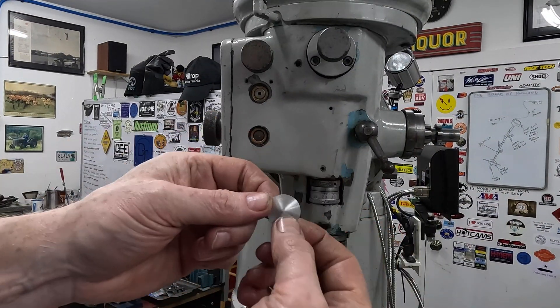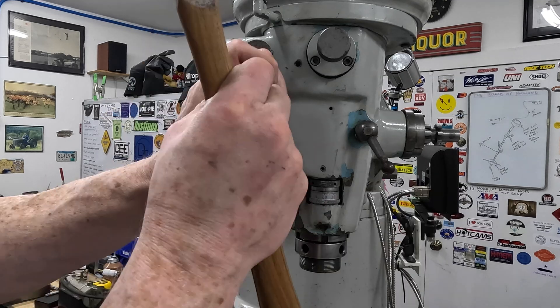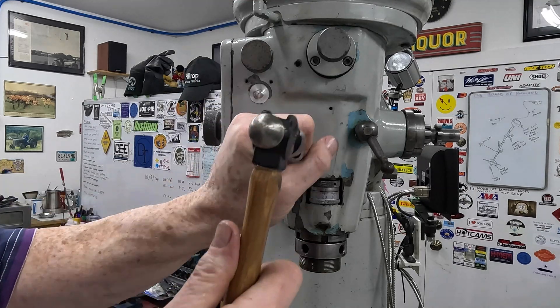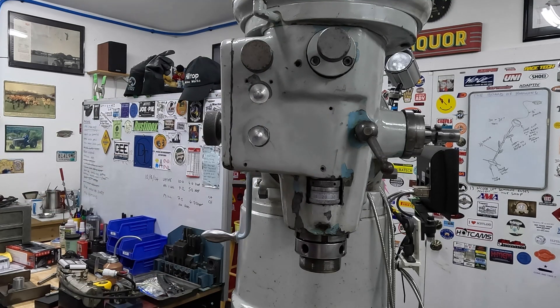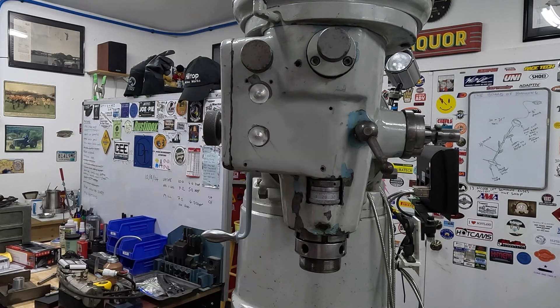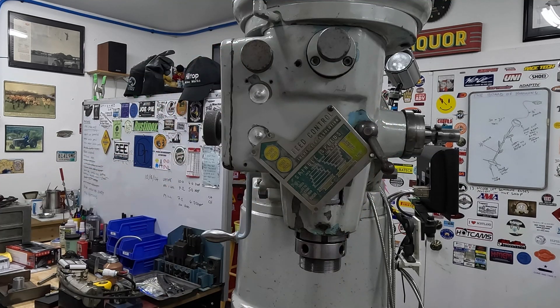Unfortunately the sound didn't take for this one. Anyway, what these are — dished aluminum discs. I just parted them off in the lathe and then dished them by forcing a steel ball into them while holding them in a tube. What I'm doing here is just mashing them into these openings, and they're just gaskets — they just stop oil coming out of the bushings at those locations. Then they get hidden behind the speed cover plate. Very simple, and they seem to have worked very well. Plus it means I got to hammer something in place, which is very important.